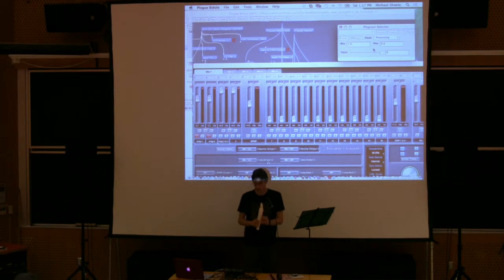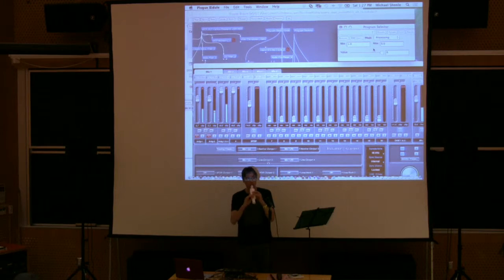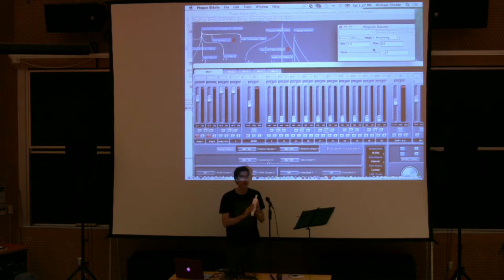Show you a little bit more about the kind of sounds you can do with a synthesizer. So it has four control voltage outs right now, one of them being frequency, 1 volt per octave, the other amplitude, which is connected to the breath sensor, and it's also a very high bandwidth signal. It's about 2 kilohertz, so you can very quickly vary the amplitude of the waveform.